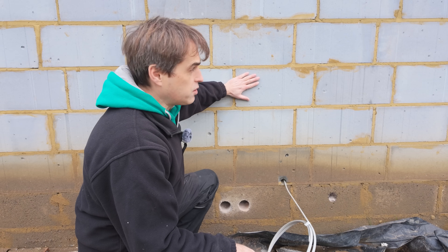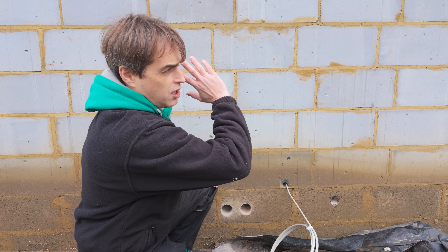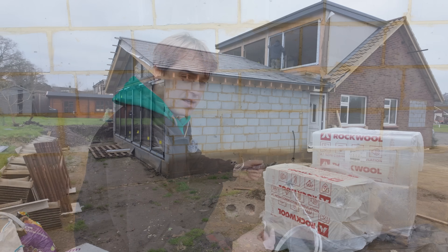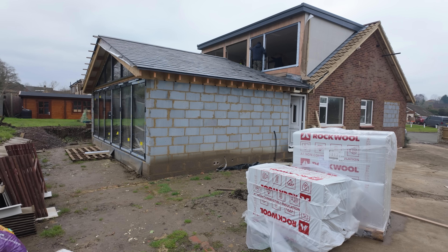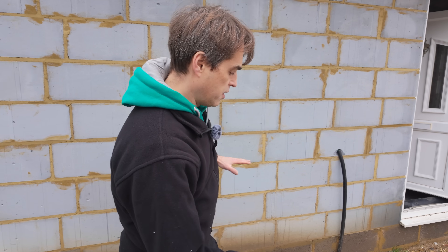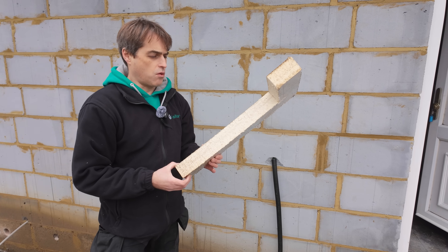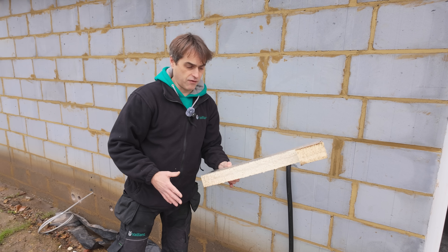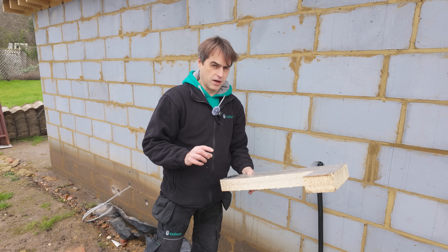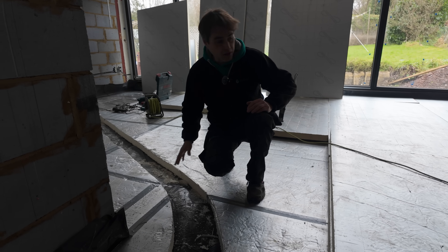Those are new cavity walls — they'll have additional 50mm insulation going over them and over the existing walls as well, so they're dropping the U-value to the current building regs 0.18. It's going to be a really well-insulated property. Inside they've done the slab and the insulation already — two layers of 60mm. We removed one layer and we're dropping our primary pipework — pre-insulated multi-layer composite pipework — below the insulation.